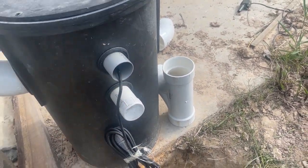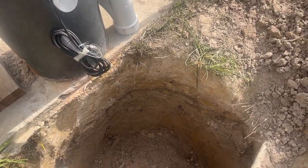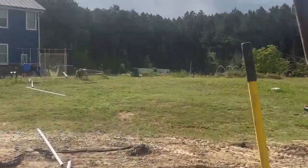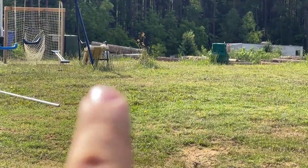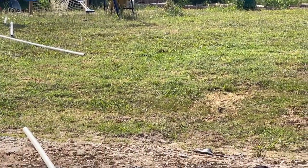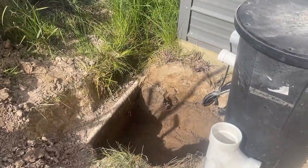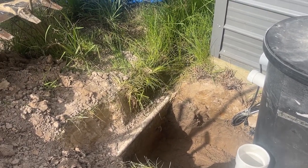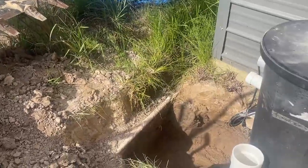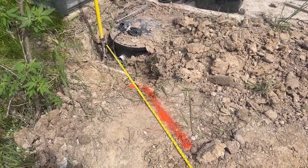We'll do a double 90 coming off that corner. Our sewer outlet comes off here — it's two inch, and there's a two inch conduit also just for the power line, which we'll need to install a plug for later. Our two inch outlet for sewage comes off here — this is a sump pump. Our septic tanks are up the hill; you can see the green aeration box and a clean-out just past the kids' slide. We're going to run basically just upstream of that clean-out, which means running right through the kids' swing set, so I have to move all that too. Priority number one is getting this tank set down in the hole and the hole filled back in, and then I'll grab the neighbor's trencher and trench through the backyard.